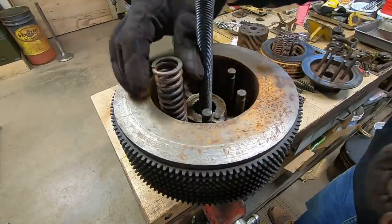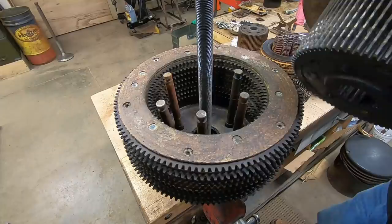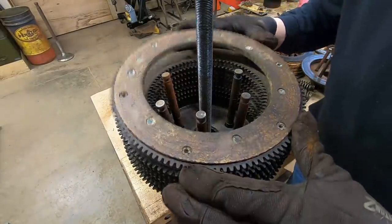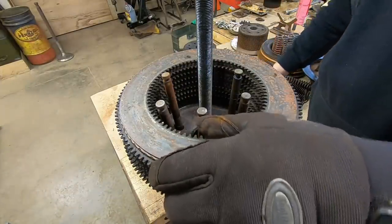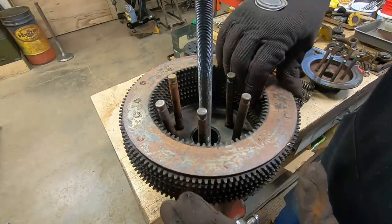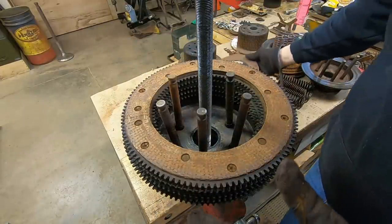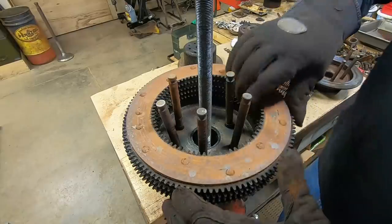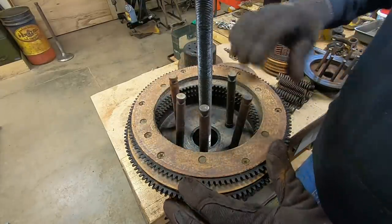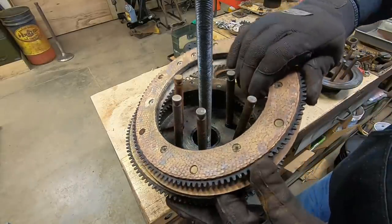Pressure plate — or sorry, center hub — off. Again, spline wear is minimal. We're slightly less rusty on this side, though we still had some in there. This had spent how many years sitting before we got it, so there's that unknown factor. Wear-wise, there's just no wear on any of these frictions. I'm sure 1113 had steering clutch work done at some point — there's no way this can be original. Just the sitting got to it. Pretty typical on D2s that sit for long periods: these steering clutch compartments build a lot of condensation and then everything suffers.